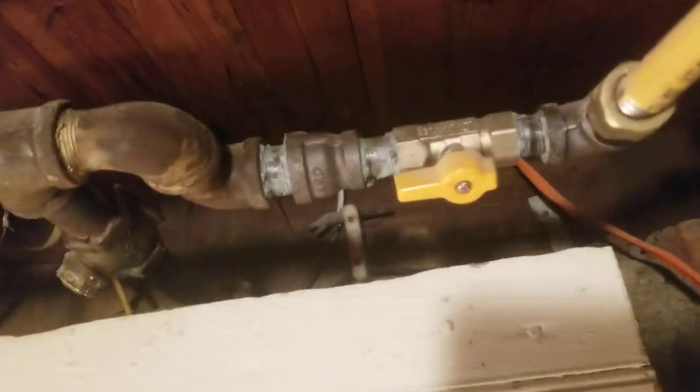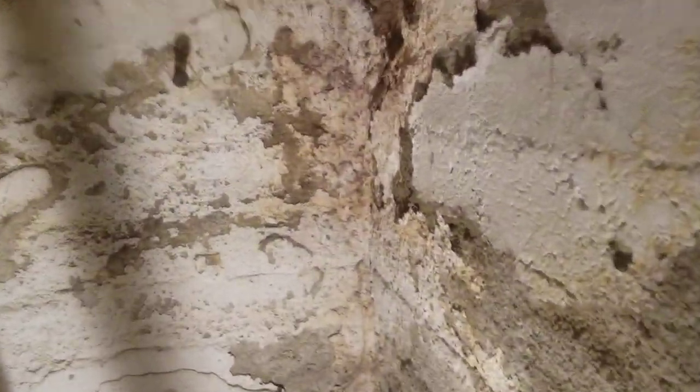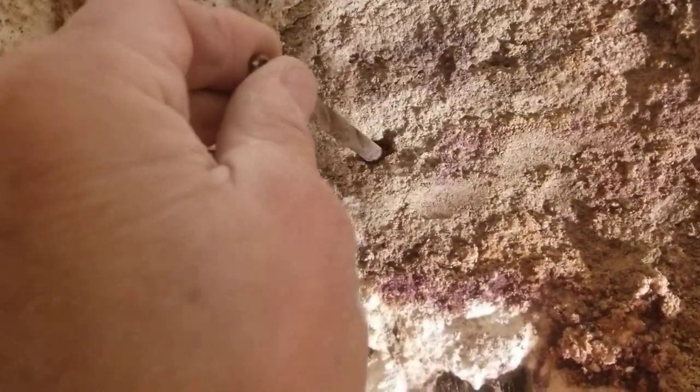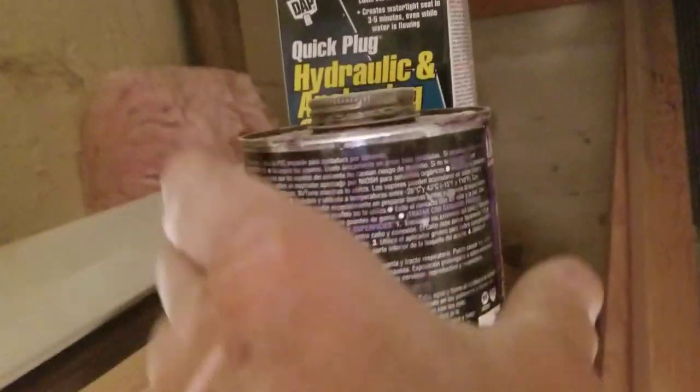Got plenty of pipe, so I need a day of no one being here to do that. I finally got these holes drilled — a little bit bigger than a 3/8 hole, but we'll put some anchors in there. I've got some hydraulic cement to hold it in there. This whole wall is just falling apart, and then we'll put this up here and screw that in so I'll be able to put plywood on both sides so it doesn't fall down.